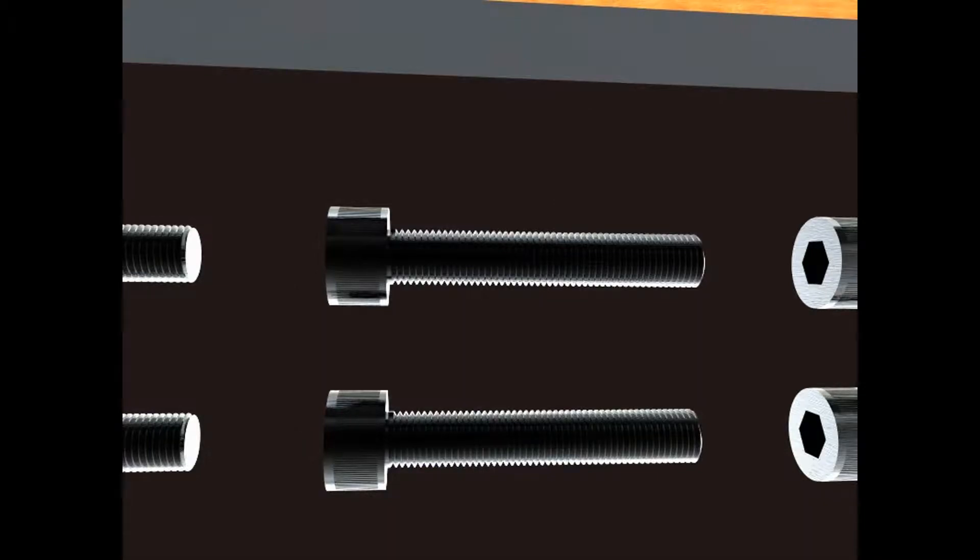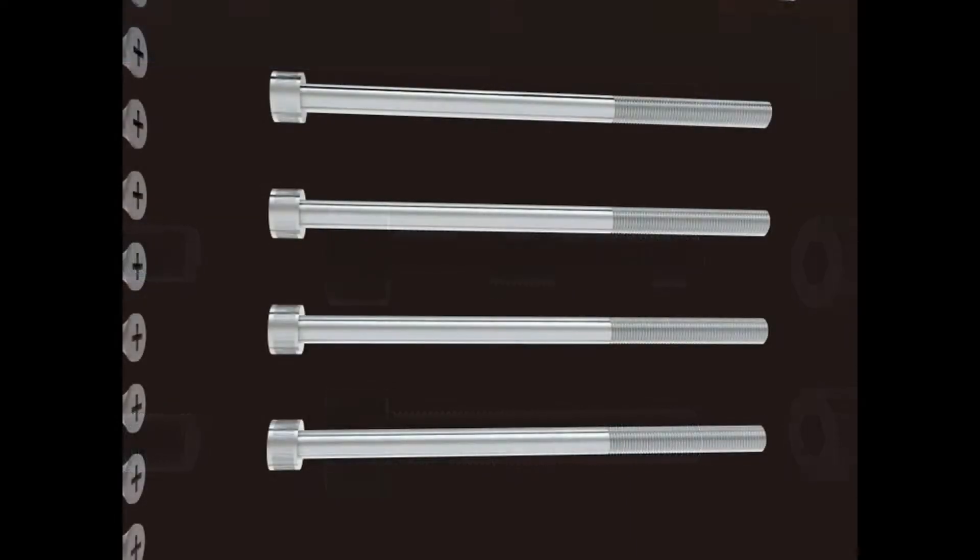Then it has the top piece, which is the clamshell part. That tightens down around the motor to hold it in place and keeps it from vibrating. Everything is double secured on that to our back section. Our next section is our bolts — standard size bolts used for attaching the stepper motor to the bracing. They also attach the anti-backlash fittings to the back support, enabling our axis to move on the drive shaft. The large bolts are only used in one location: to attach our clamshells to our back support, which wraps around our cutting motor — the Porter Cable.